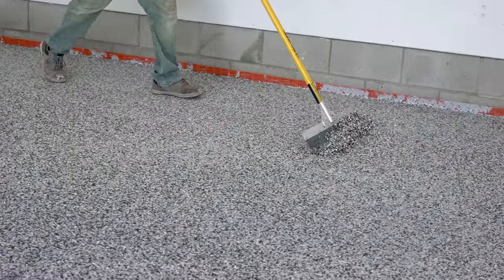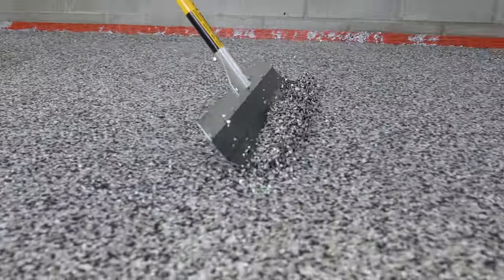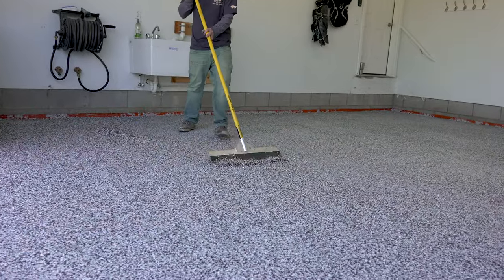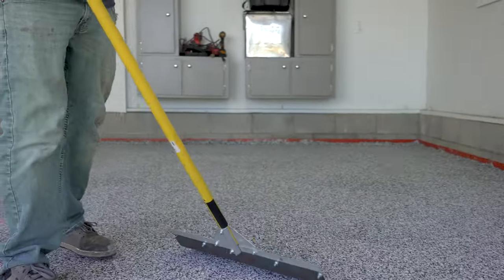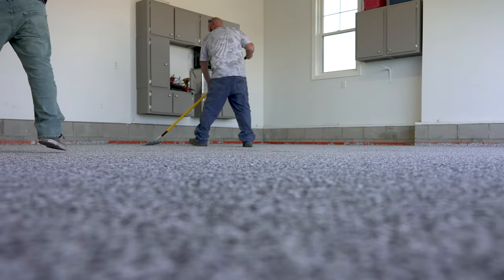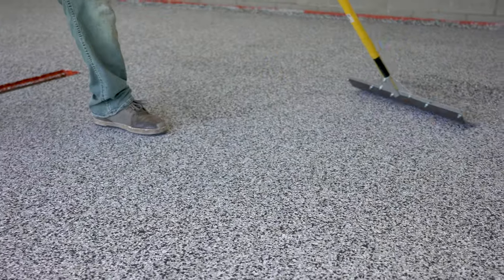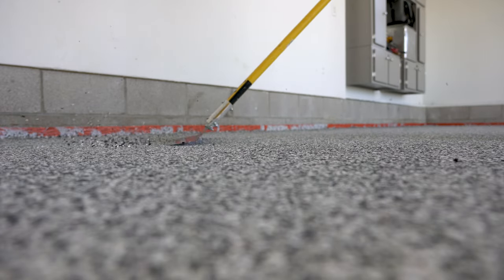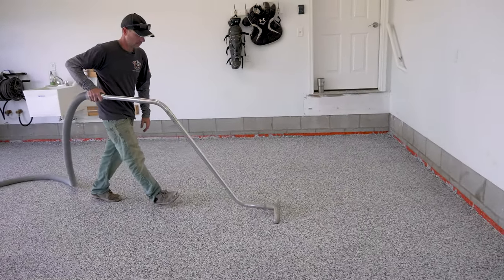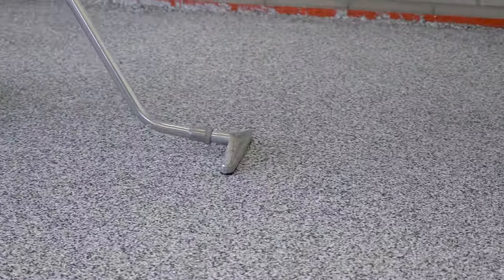Or on the first pass, just push all the chips to one side, pick them up, put them back in the box, and reuse them next time. After that, make sure you scrape in three different directions: north and south, east and west, and then once on a 45-degree angle — that way you know everything is shaved down nice and flush. One of the worst things you can do is not scrape enough chips off, which makes you use more top coat and leaves the floor really rough. The idea is to scrape and shave that last bit to get the perfect texture. Then run a vacuum over it to pick up any loose pieces before top coating.